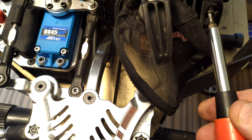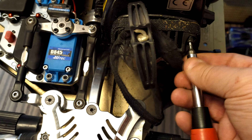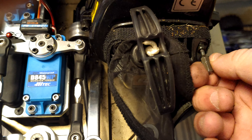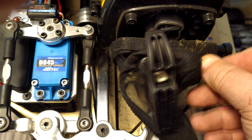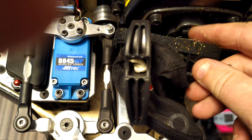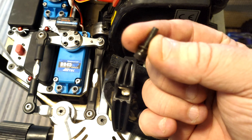Leave this one until last because it's the easiest to get to. Once you get it so far out, you don't need the screwdriver handle and you can just back it out using the screwdriver bit itself. Watch they don't fly away because these have spring washers on them — sometimes the washers are captivated and sometimes they come off, but you don't want to lose them.